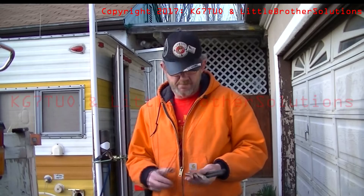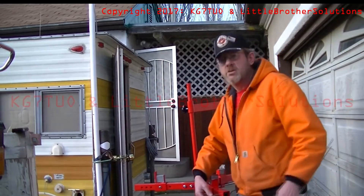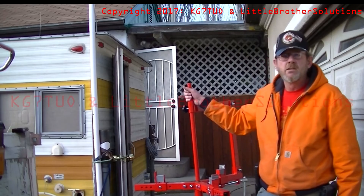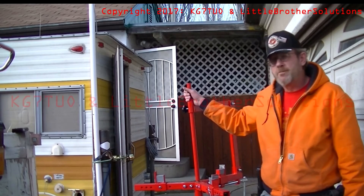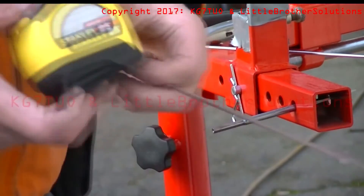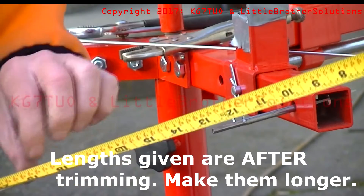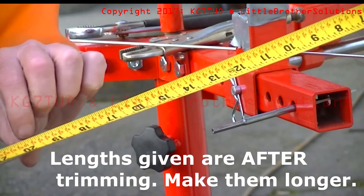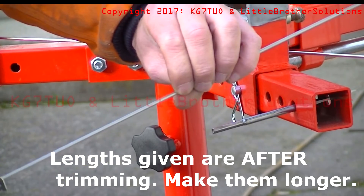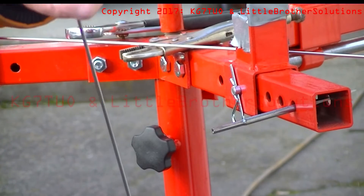This works best for me — a pair of vise grips and a drill bit placed into a hole on my motorcycle-changing setup. Because we're making this for two meter and 70 centimeter, we need about 19 inches on the two-meter side and about six to seven inches on the 70-centimeter side, so we'll pick a spot in between those two from the two ends.